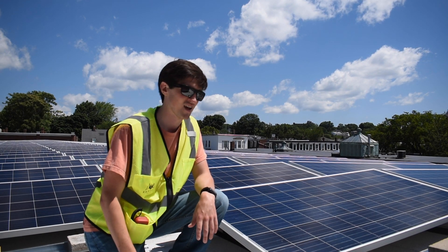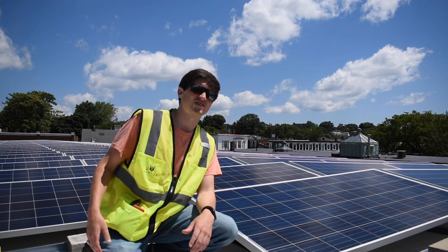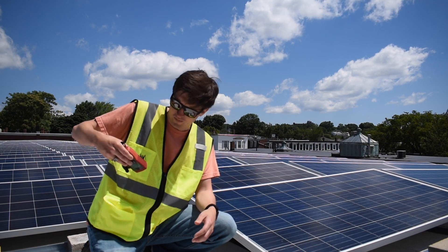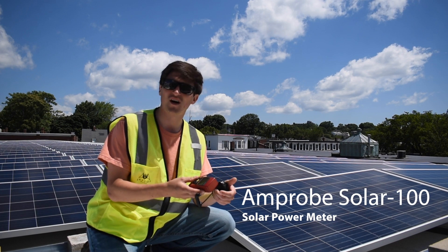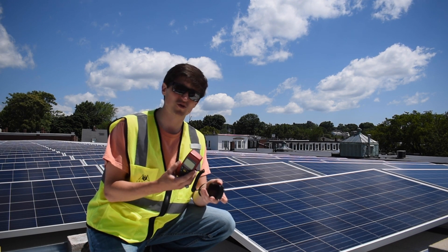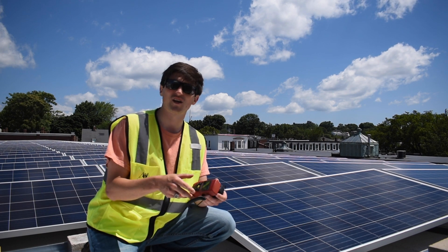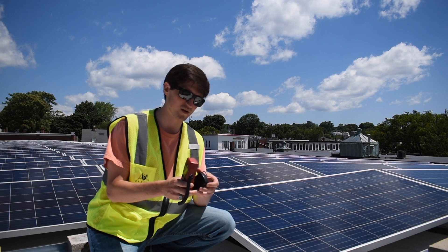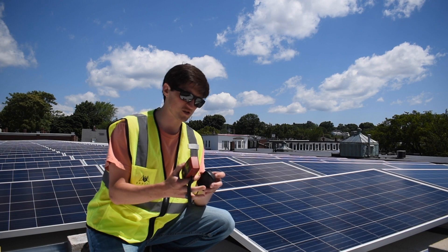So the question is, how do we measure irradiance? Many solar sites will actually have a pyranometer on site to measure this, but we can also use a handheld one. I have one here today — it's called the Amp Probe Solar 100. You can just get it off Amazon. I would note this is not a lux meter; lux meters are used in buildings and lighting. You want to use an irradiance meter for solar, not a lux meter. The irradiance meter measures watts per meter squared or BTU per square foot.